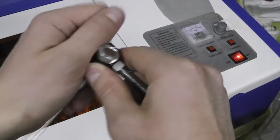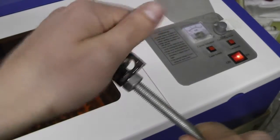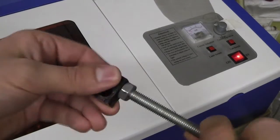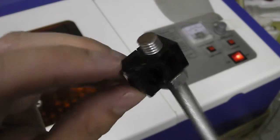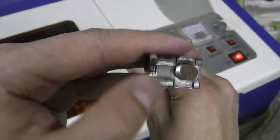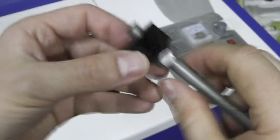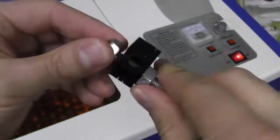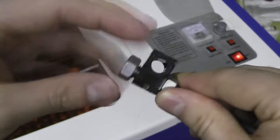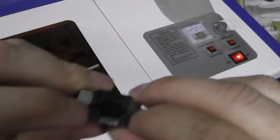It should be fairly strong as well, because I'm not directly relying on the strength of the cement — the glue which welds the plastics together — because it has these cut-ins. Within the surface there are these cut-ins which mean the force is pulling on the other piece directly, and when it's all bolted together it's the force of the nuts jamming it together which is forcing these two pieces to lock onto this piece, giving it strength in this direction.